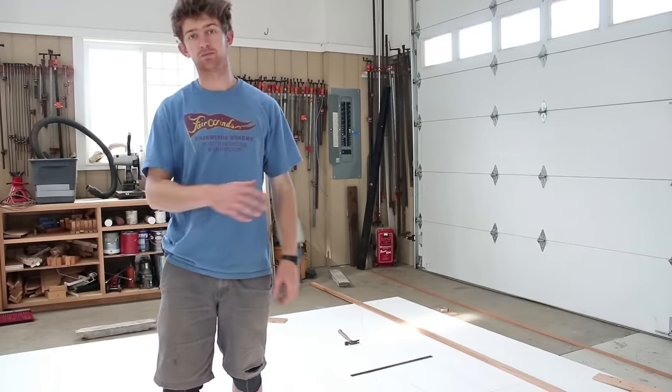Alright, well I've now got five diagonals fared out on the floor. I've got three water lines as well as the shear line. What I'm going to do at this stage is take the points back off the water lines, back off the diagonals, take them back to the body plan, and what I'll be doing is adjusting the lines of the body plan to go closer to those points or through them. Now probably once that's happened I'm going to be coming back to the water lines and to the diagonal lines on the half breadth view here and be adjusting them again.